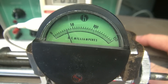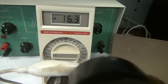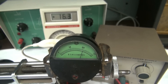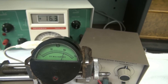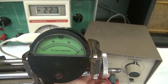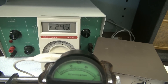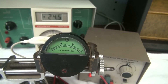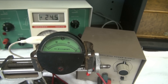Remember, this is a 0 to 150 milliamp scale. I'm going to take it up to about 100 mils. Look at my meter — I'm actually pulling only 16 milliamps. That's because a lot of these meters, even though they have a 150 milliamp scale, are much lower than that because they expect you to put a shunt in line. So let's take it to about full scale — there it is, about 24.5 mils. This is actually a full scale 0 to 25 milliamp meter. If you're going to use this in a transmitter or other purpose, make sure to put the proper current shunt in line so you don't damage the meter.